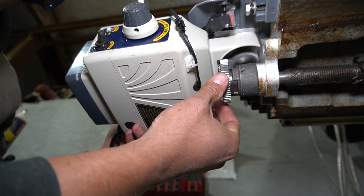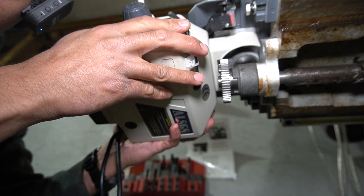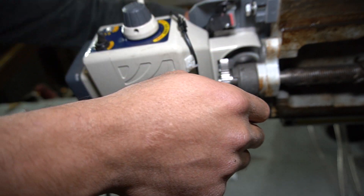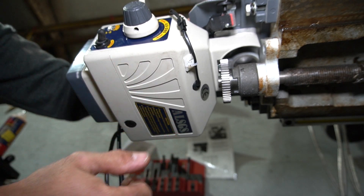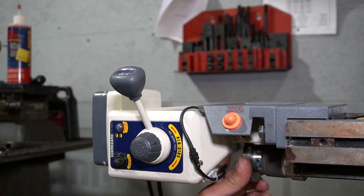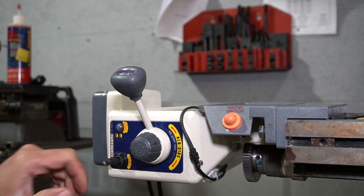You can see this is the gear on the table and it has to mesh with the gear on the motor. I basically had to push this all the way forward. I'll go ahead and snug this up on the table to make sure it's meshed properly — this is a bit of a three-handed operation. We need to put some graphite grease on the gear down here; the instructions say do not use silicone grease.